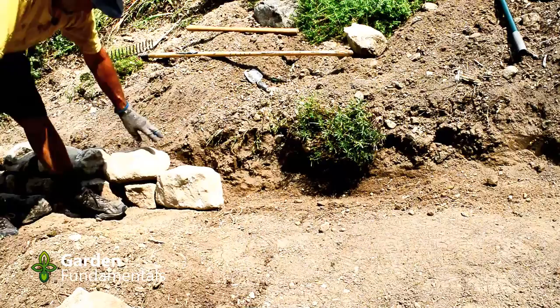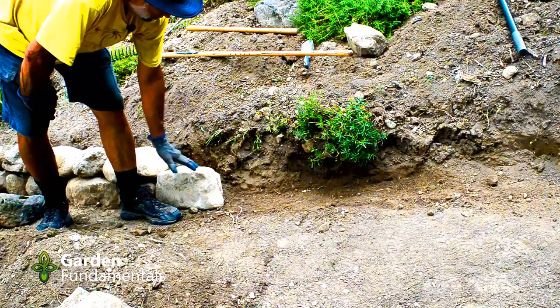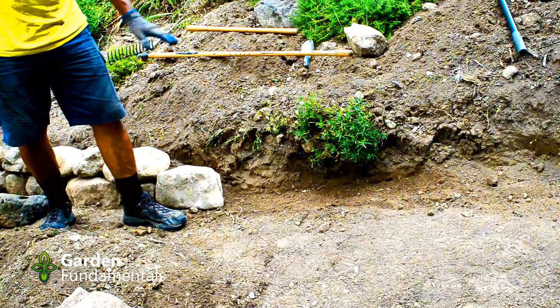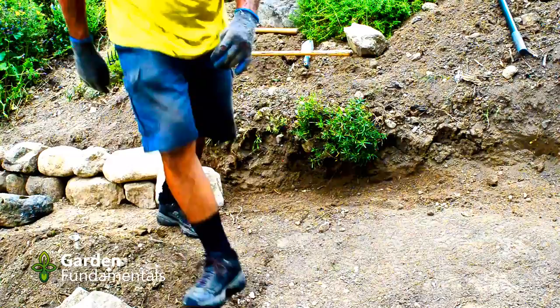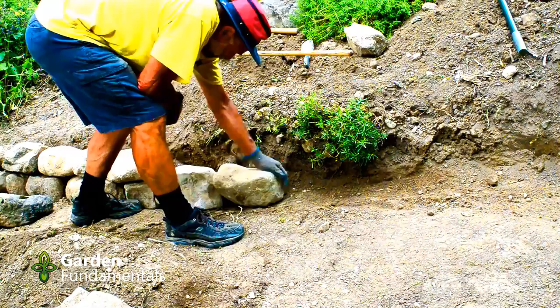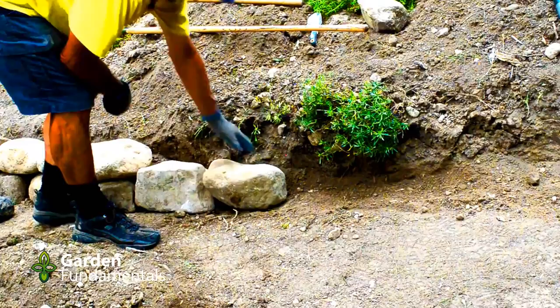So I have part of the wall finished here. Prep the bottom so it's sloped a bit towards the hill. The first thing I do is run the bottom course out three or four rocks, then I come back and do the second course covering the same crack, and move on like that. You could do the bottom course all the way, but I kind of like doing it in stages. Now I need a rock that's flat-topped, about that high — use your fingers, that's your measuring stick, it's not that exact. Now I gotta go find a rock. This one's not too bad, about the same height. I think I can make it work. It's heavy enough, it's stable — it should be okay.